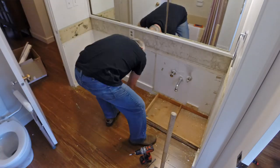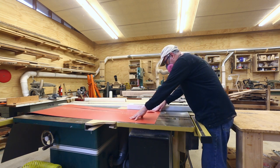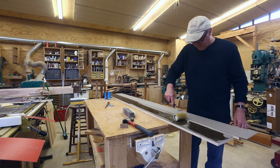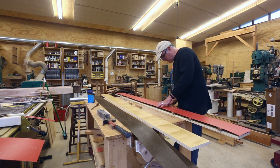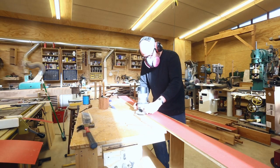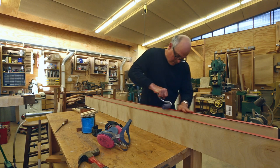What I did a little bit different in this bathroom is I put in a backsplash at the back of the counter. I built that by taking a scrap piece of three-quarter inch plywood used for the cabinets and attached some of the same plastic laminate to that strip. I cut a six-inch wide strip of plywood and slightly wider strips of plastic laminate, put contact cement on each, let them dry, and then used the same technique of holding the two apart slightly with scrap pieces of wood, working from the center outward, then rolling the surfaces together to apply pressure to the glue. I then flush trimmed the edge of the plastic laminate. I also cut a really thin strip for the top of the backsplash and used the same contact cement technique.